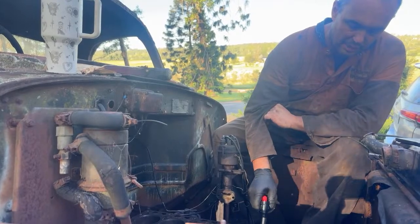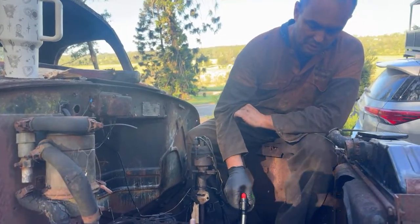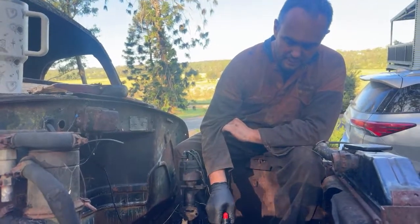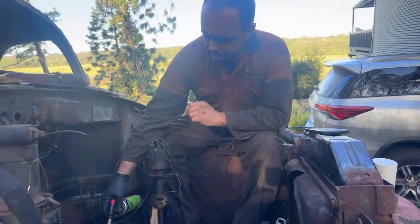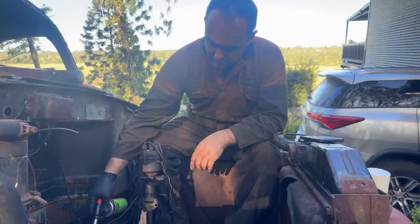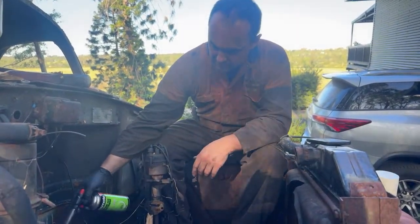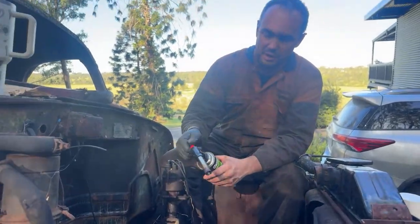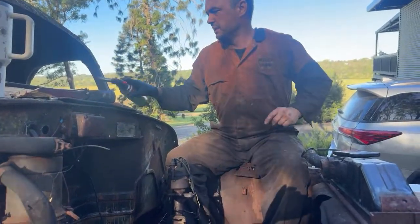It was locking it up, plus it was struggling to turn it. So I put a wedge washer under one side of the starter, and when I initially welded that cone on, it was right, but now because we moved the bell housing, it's closer to the flywheel and the starter jammed in there, so it's starting really good now. I graded the shed with it, a bit of grass off the side of the road, and then turned her off again, so I'm very happy with it.